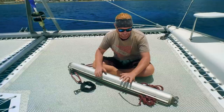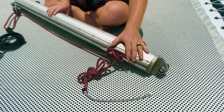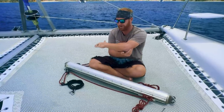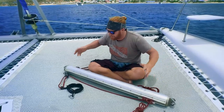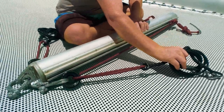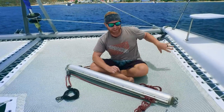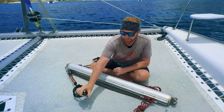We are finally at the stage of drilling the big scary holes — I say that having drilled a lot of scary holes already. We've added some cleats found on Amazon and made up some Dyneema lines. Because we want it to be adjustable — to be able to swing it up and down — we've come up with this crazy solution: a Dyneema friction ring system, that'll all make sense later. Now we need to get on with the bigger, scarier holes — today we need to drill six holes down by the waterline at the bows, to hold down these black lines which have pad eyes to connect to. That'll act as the lateral forces to counteract the pull of the halyard.